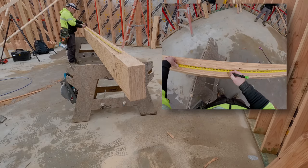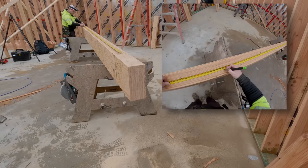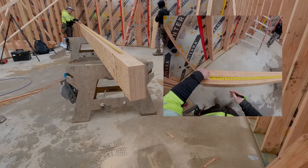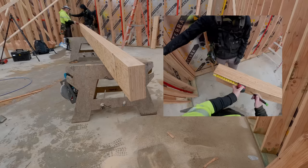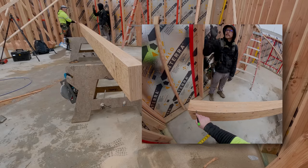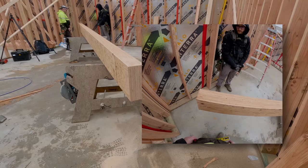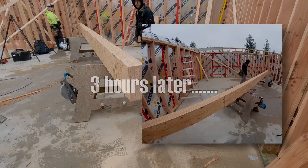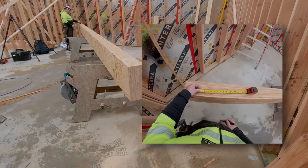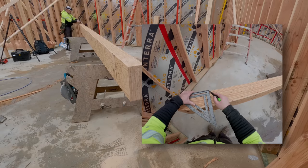Whether it's storage or whatever — it's like my theater room: it'd be all quiet, somewhat insulated. Yeah, because it would vibrate up through the slab; maybe it wouldn't be as loud upstairs. So this last one, I'm thinking we may need to shift, because if our wall is five and a half inches there's the amount of room for insulation. Since it bears here, I kind of think if I go six inches back it's easier to get insulation in there. Two will sit on that top wall, so I'm going to go six back — inch and three quarters. Cross those out. There's just more to it than just framing: my primary concern right now is structure, but I also have to be thinking about future trades like insulation.